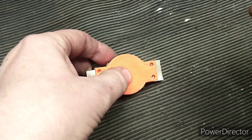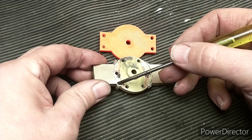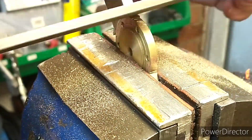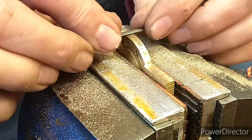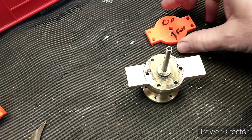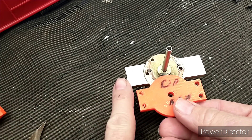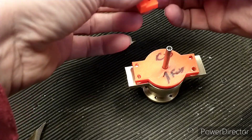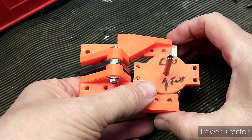Off the miller now, we've got these reasonably equal. There's a bit of a mess here because I didn't want to come into the circular part, so I just need to clean those up with a file. The last job is to face off these ends to size — I'll make it slightly wider than the current size because the bracket will overhang, so basically the width of the brackets will probably determine how wide we go.